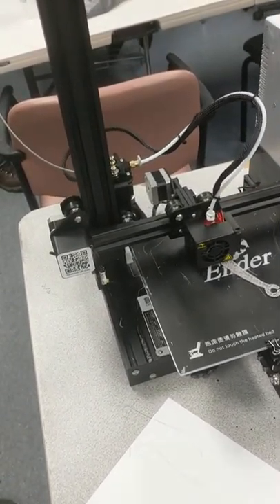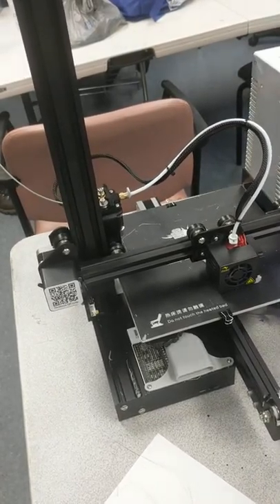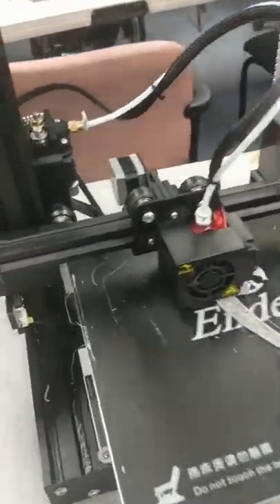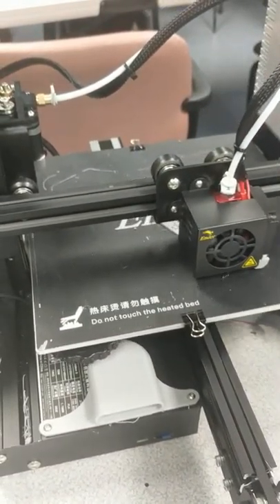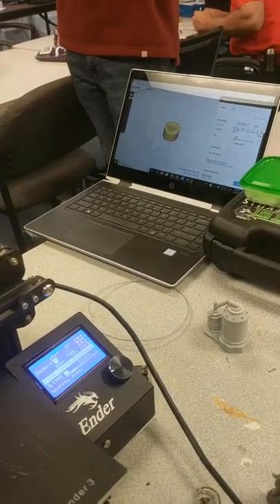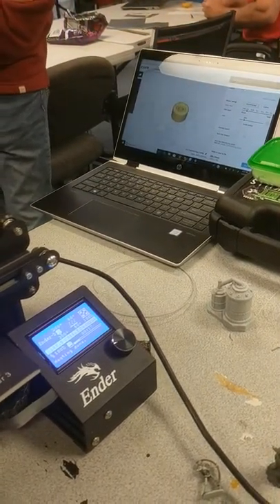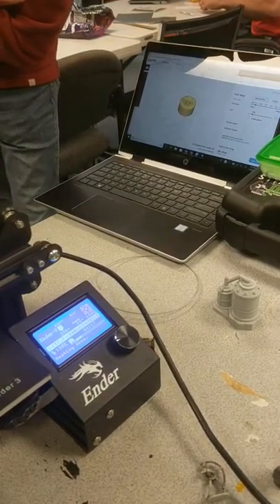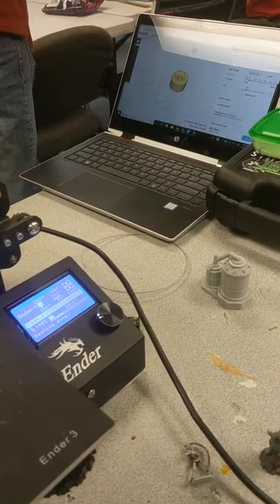It's not printing well — it's printing pretty badly right now. To be fair, I got this new printer today, it was just given to me. You'll adjust your profile over time — you'll download Cura, get the profile, run it, and you'll see the numbers change. It's under-extruding a little bit, so I might go tweak the temperature a little bit.